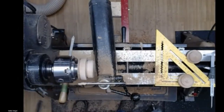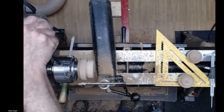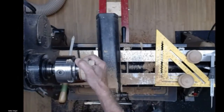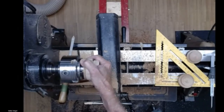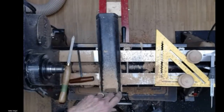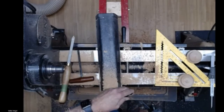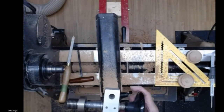That's the relief. If you do hand chasing, it's mandatory. It's a nice detail when you're doing it this way. If you wonder how this goes, pick up the medicine bottle on your kitchen table and take a look at how threads are done in press outs. They have the same thing. There's a certain degree of relief back there to keep the caps where they screw down tight and not bind on anything. And that's what this is going to do.